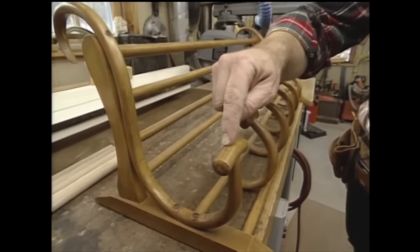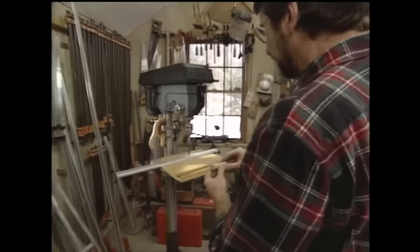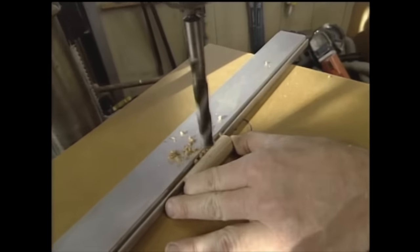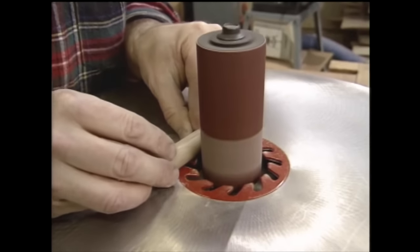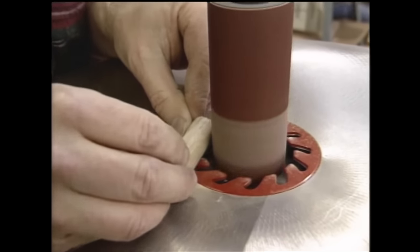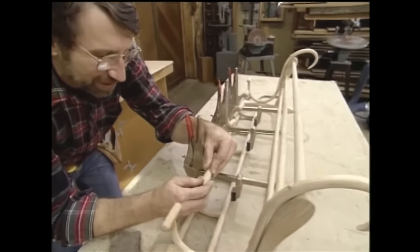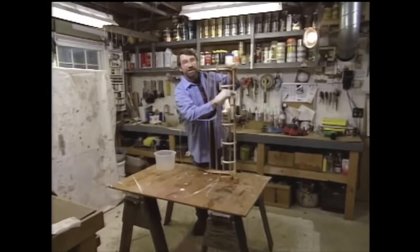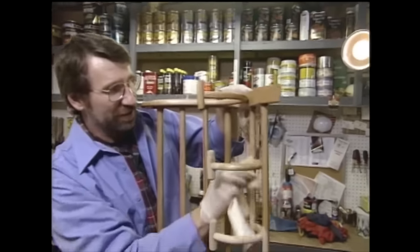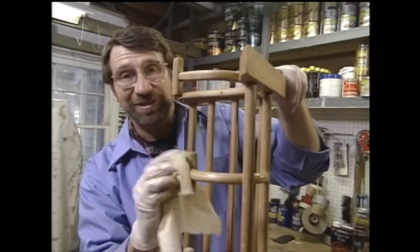Now I'm ready to create these little elements which complete the T of each hook. I'm going to start out with some three-quarter inch dowel stock and drill a half inch hole. The way I'm going to get these pieces to look hand-made is to sand them. To attach the T's, I'm not going to use any dowel or brad — I'm just going to depend on the glue. For a finish on our bent wood hat rack, I'm using a wipe-on polyurethane. It gives you the look of a hand-rub finish, yet the toughness of a polyurethane. A couple coats of this and we'll be ready for the hats.